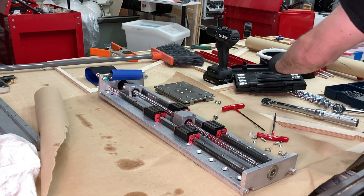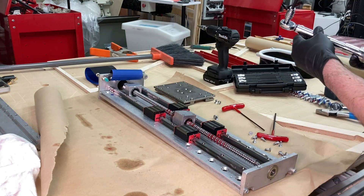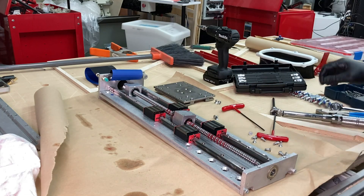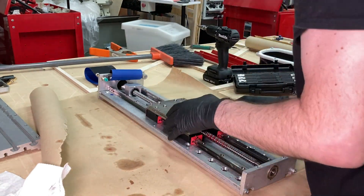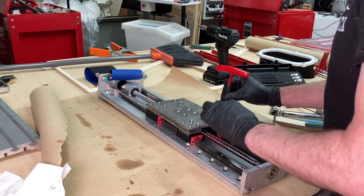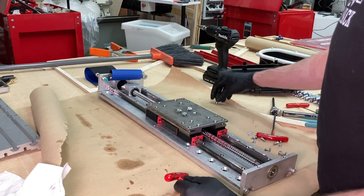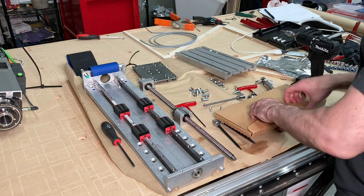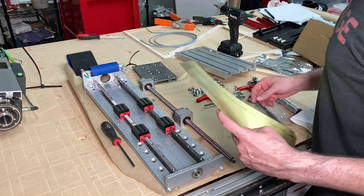I actually assembled and disassembled this many times. I noticed that the bottom of the ball screw would shift over to the right as the carriage traveled up toward the top, which meant something was misaligned between the ball screw nut and the top thrust bearing. I could not figure out what it was. I talked to Avid and they said that sometimes you need to shim either the carriage, the ball screw nut, or the top thrust bearing to get it to line up properly. I wasn't a hundred percent convinced that's what it needed because it was shifting left to right rather than up and down.